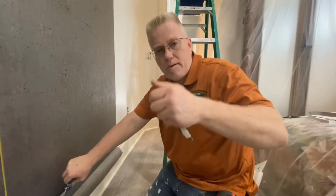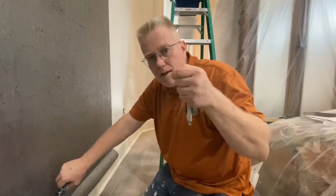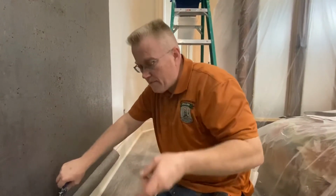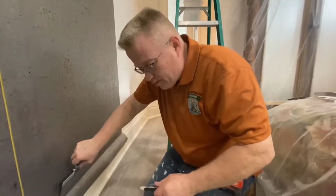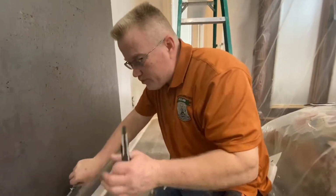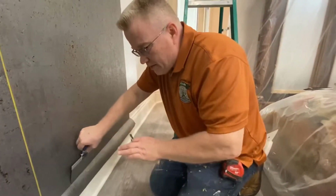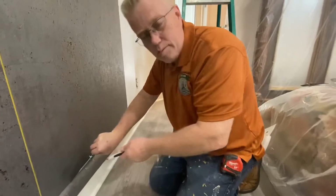If you take a cork from your wine bottle and you push your fingernail into it, you can see that it goes in, you can see the dent. Same thing here. If you don't push it sufficiently and dent it sufficiently at the corner, you won't cut enough wall covering, and you'll cut too much wall covering. If you don't press it firmly against the woodwork, you will not have a nice clean cut. What will happen is you'll cut your wall covering short.